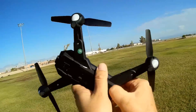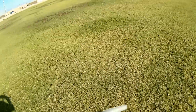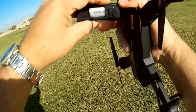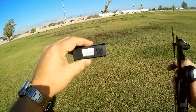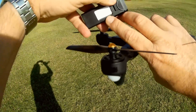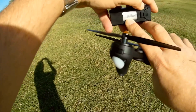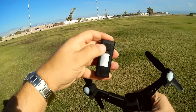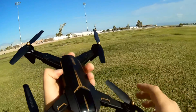One other thing about this drone: it is powered by quite a large battery. It is a 1800 milliampere-hour, 3.8 volt battery. 1800mAh should give this quite a bit of flight time. Additionally, it is a LIHV battery, which means its nominal voltage is 3.85 volts and its max voltage would be 4.35 volts when topped off. That gives you a little more power than a standard LiPo battery, so you can fly a little bit longer.